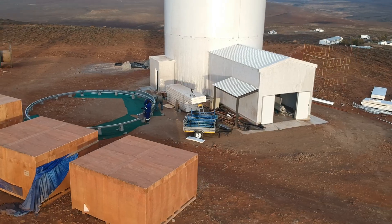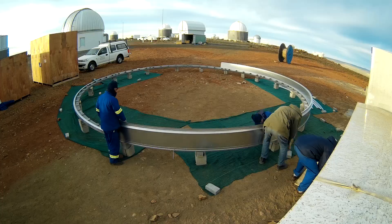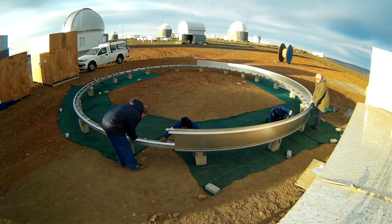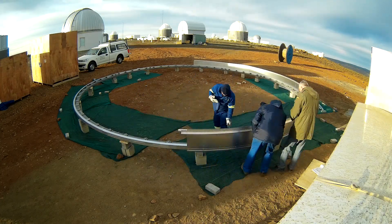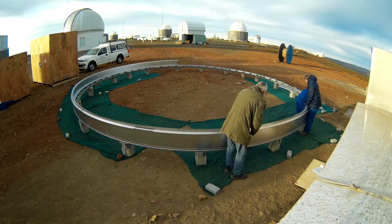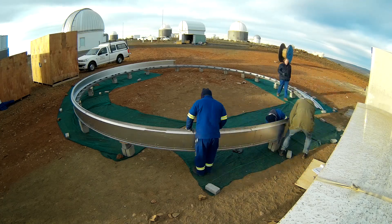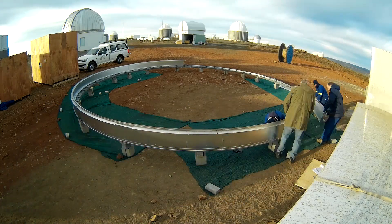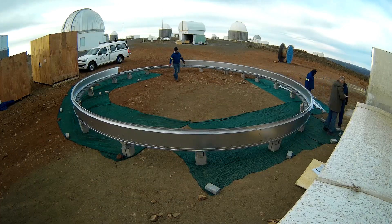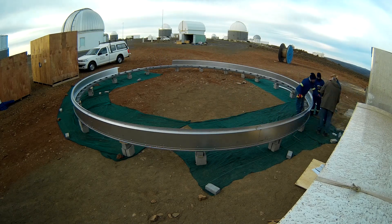The dome was positioned close to the building for the crane to just pick up and install it. Also note how neat the groundsheets were still — compare this to part 3's video after they have been through a few storms. The convenience of the groundsheets is invaluable when rotating the job as you progress. Being an even number of people worked well as we mostly needed to work together in pairs. A valuable tip from Raleigh was to leave out the last skirt section until the gear rack is mounted, to aid access to the final joint.